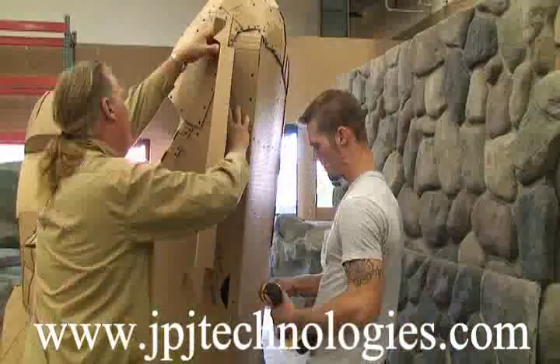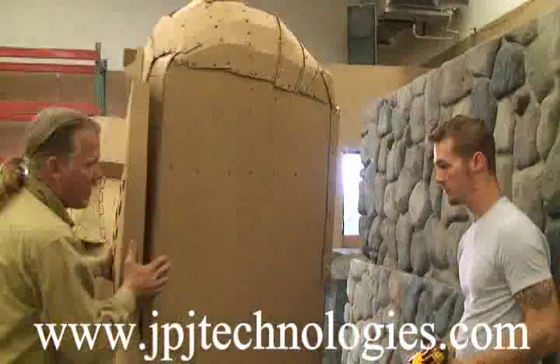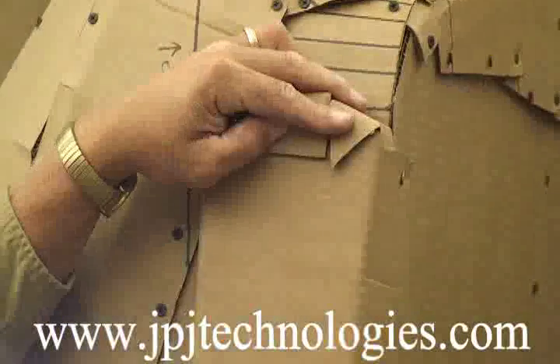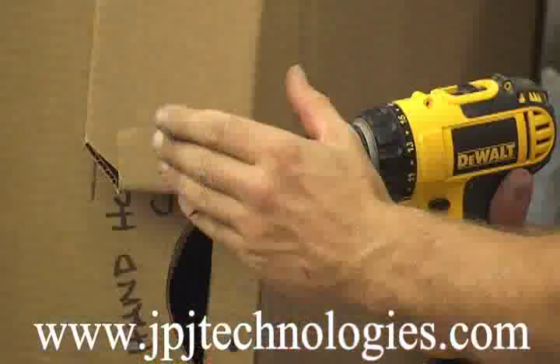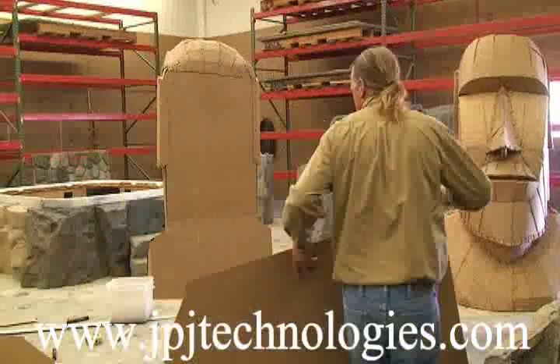You're going to see me tape a little bit because I said I wasn't going to seal it, but then I decided to seal the cardboard so that it wouldn't get wet. If it gets wet, it loses its rigidity and as a form it would collapse potentially if there was wet cement put on it, so the cardboard needs to be sealed.